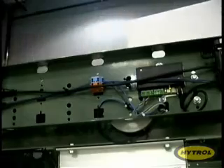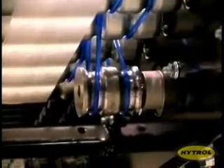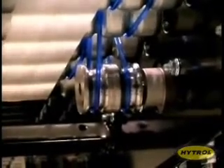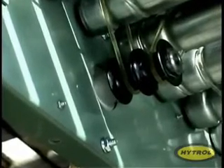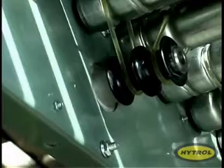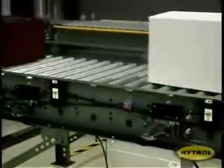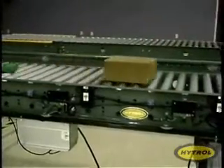The E24 drive motor is mounted to the side frame of the conveyor, and its shaft is fitted with a drive spool for powering polyurethane bands used to transmit power to the tread rollers. The motor shaft can also be fitted with a limited slip composite spool that allows the motor to continue to run even in a backed up situation that would cause overloading or overheating of motor driven rollers in conventional 24-volt systems.